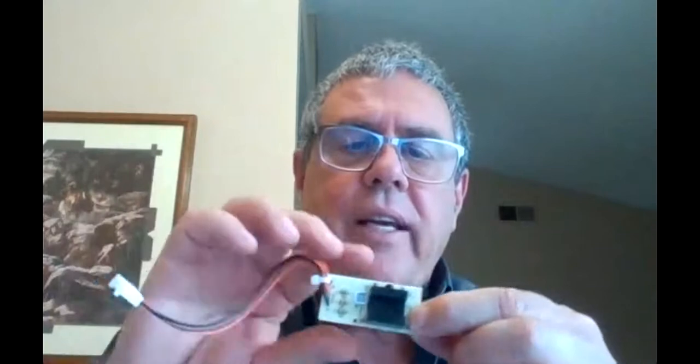But good question. Can I show you 3 items that I have found in the field that are important? Technical, this is our RPM sensor, and this mounts right on the motor itself. It's got the 4 connectors. Now this one looks identical, except this piece comes off, and this board has been found to be lying inside the opener. So if a guy gets 7 flashes, he'll have to reprogram it and then hook this back up.